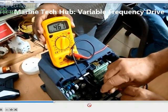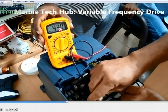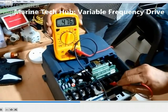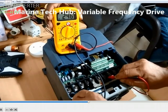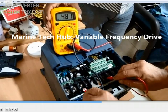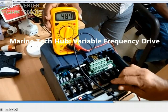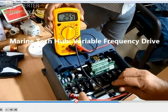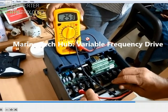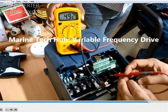When you check the other side, the first one is showing more — you see. The other one 0.24, 0.43. I want to show you here again one more time. The first reading is 0.246, the second reading is 0.247, the third reading is showing more at 0.482. So there is a problem here in the third reading — the inlet side of the unit. The third reading is showing wrong, so the inlet side has a problem.